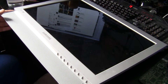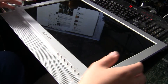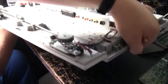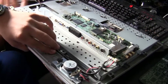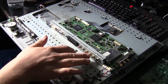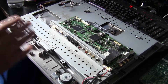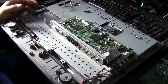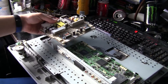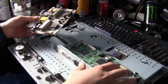This is basically a LCD monitor slash TV, so it has all sorts of inverters. What you want to do is strip it all down so you get all your backing panels off, and as you can see it has all the channel inputs — it has SCART, DSUB and DVI ports here. What you want to do is take out the board over here, and that is your power board, which powers everything from your back lights to all your control units.